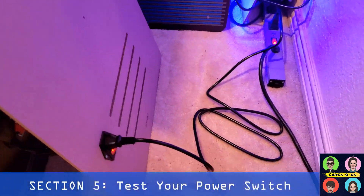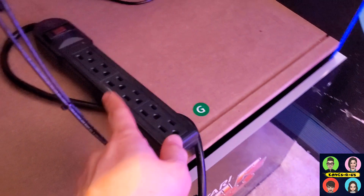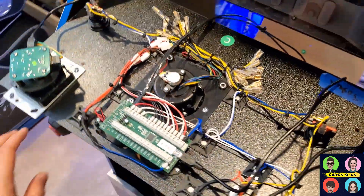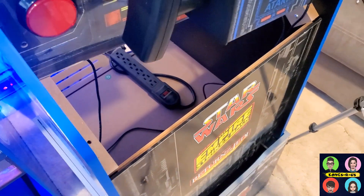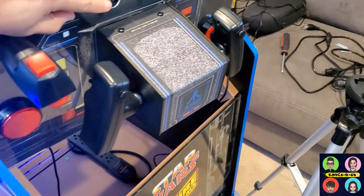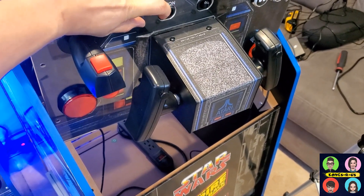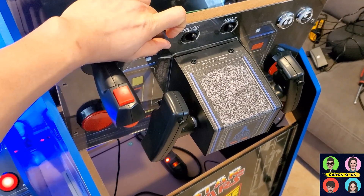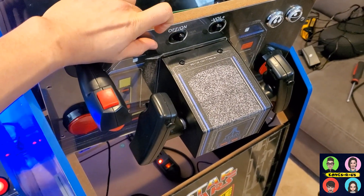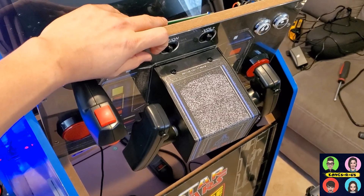Let's make sure everything works. We have our inlet module switch in the on position — it's connected to our surge protector, but the surge protector isn't turned on yet because we haven't turned on the Arcade One Up power switch. Moving to the front, we'll flip the power switch on and you should see the surge protector's power indicator turn on. This is now a remote switch for the surge protector, and it's going to power on your monitor, LED buttons, marquee, and sound. We'll set up the PC BIOS to turn on as soon as it detects power — so this safely starts everything up. To shut down, you shut down the PC normally, then flick the switch and everything's off.